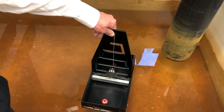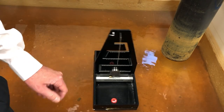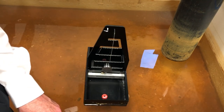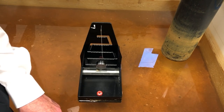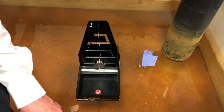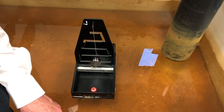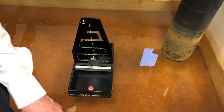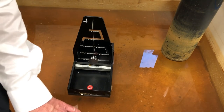The trick is to get the ship going without water coming over the gunwale and taking water on — that really screws the results up, and it screws a lot of things up on a ship. We'll go one more time with the roll time. You can use your video to time it or whatever method you like. I would use the largest roll first; the smaller one should give the same result, but it's easier to measure with the largest roll.